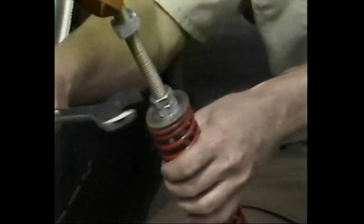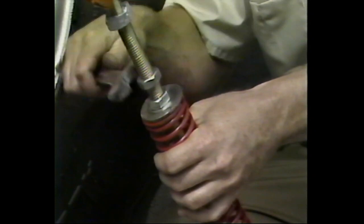Continue the installation of the ladder by attaching the latch assembly to the underside of the extension floor. To do this, place the strap provided between the latch assembly and the extension floor. Then secure both the latch and strap with 3/8 inch by 1 inch carriage bolts. Make sure the heads of the bolts are on the extension floor and not on the latch assembly. Now, release the lock nut on the assembly and turn the inner nut to release the tension on the spring. This must be done before the assembly can be attached to the ladder.